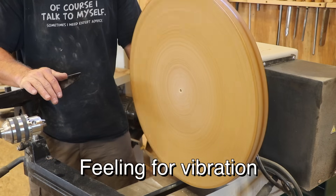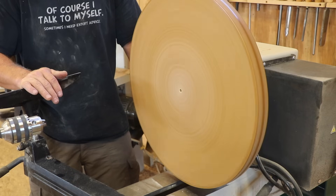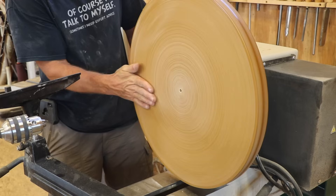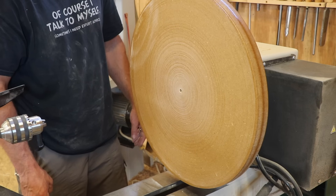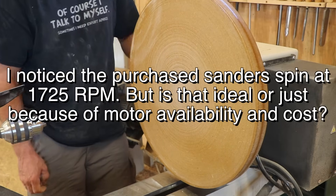At 340 RPM I can't feel anything. I can feel a little bit at 480, but it's really not much. At 500 it's nice and smooth. How fast can I spin this thing safely? I have no idea. There's 750 RPM. I'm actually curious what people think - what should my RPM limit on this be? A lot of fairly big diameter things have a relatively low RPM spec. So 750 is probably faster than I'll want to spin this thing. Comment below, tell me what you think.